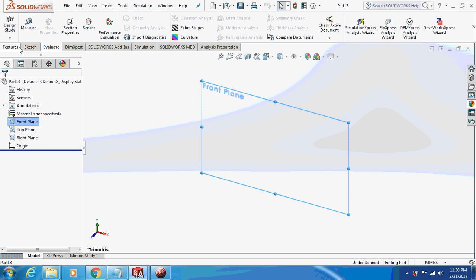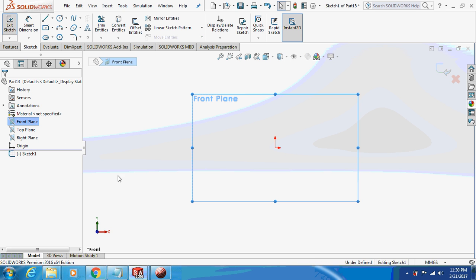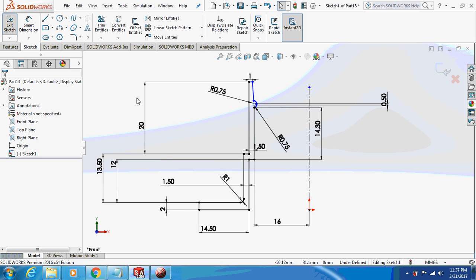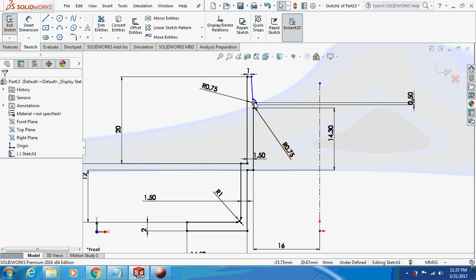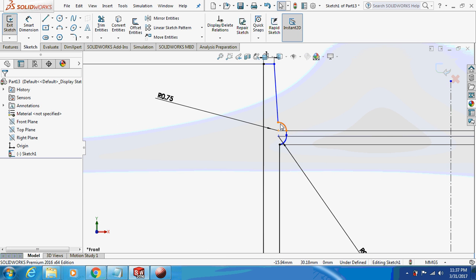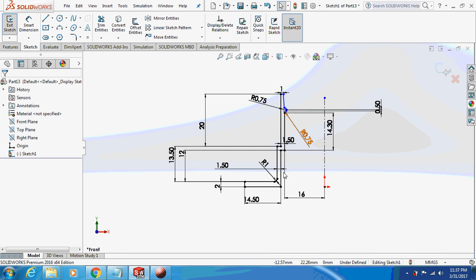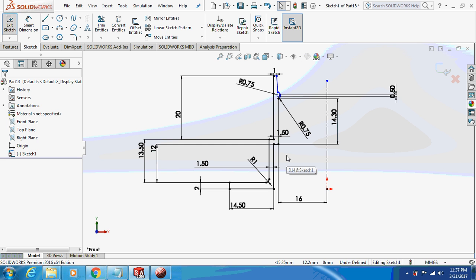Sketch on the front plane. This is the sketch you're supposed to draw — it's a basic sketch. The radius is 7.5, this side is 7.5, and the middle distance is 0.5, so the height becomes 2. Just pause the video, take the dimensions, draw the sketch, and revolve it about the axis.